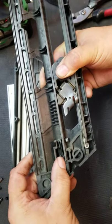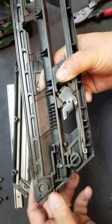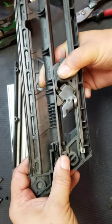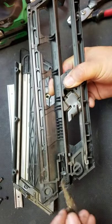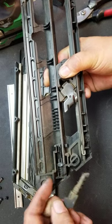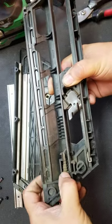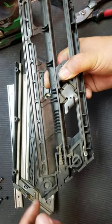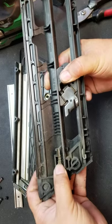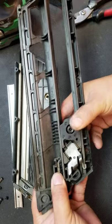If you want, you can put a little bit of grease on there — it keeps everything in. There is a little bit of tension on that spring, so keep your finger over the top of it. The other piece: this spring goes on that shoulder like so, and then locks in on the back of that plastic piece you just put in. This spring doesn't have as much tension. Put your finger on it and ease the feeder forward to hold it all in place.